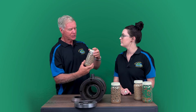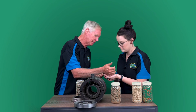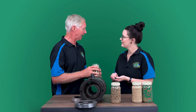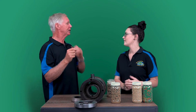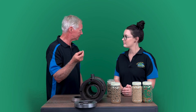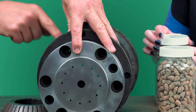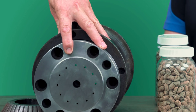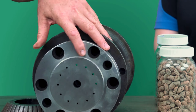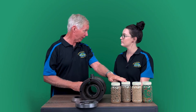We've got another pellet here of similar size, but if you look at it, you'll notice that firstly it's a little bit more curved, and secondly, if you feel it, it's really light. This is a pellet designed for waterfowl. Most waterfowl want to feed on the water surface, so you want the pellet to float. To make it float, we make some changes to the setup of the extruder such that the pressure on the upside of the die plate is really, really high. So as it comes out of the hole, it's coming out at enormous pressure and it expands — it fluffs up, and now it'll float. That gives us our floating waterfowl food.